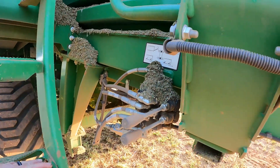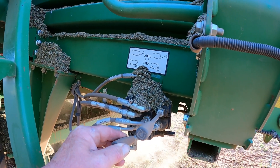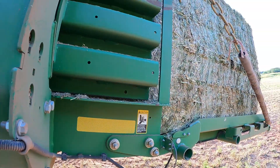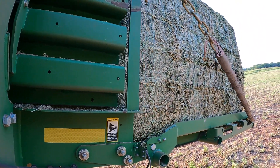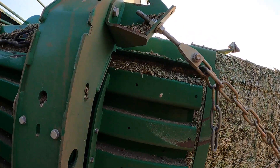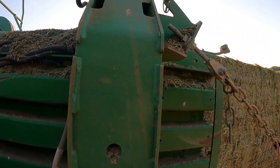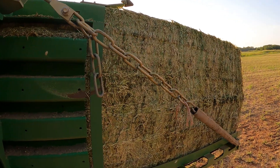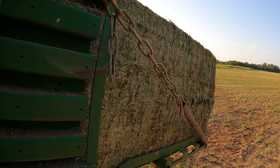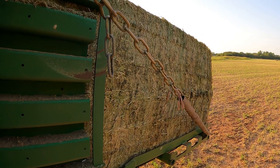We're going to run our hay dogs in using this lever here — run that in until it stops. Now if you watch, I'm going to move this lever and just eject that slightly. You can see the bale moving off the back. We've got a little over three quarters of that hay still in the chamber. If it's hanging out on that chute — especially if you're going to road this baler down the road — you really don't want that bale to fall off the back of that chute. So we're going to go ahead and eject that rear bale.